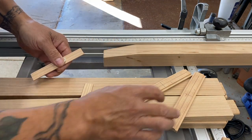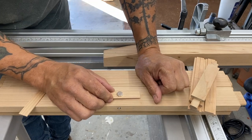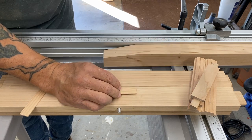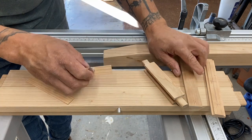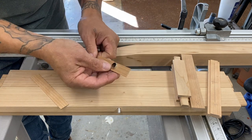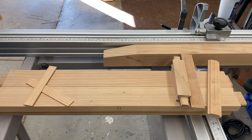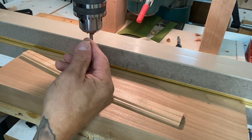To test my magnet strength I can simply use two of these, and that'll be the strength of the magnet. This is my latch — it attracts that way, it repels by flipping it over, and that'll activate the catch quite aggressively. The two halves will also attract to each other quite well — almost too much. I could probably use a three eighths. I was going to put two magnets but I don't know if it needs it. I might experiment with a three eighths before I bore the holes.